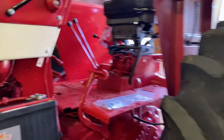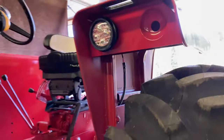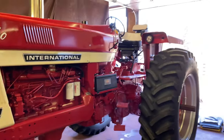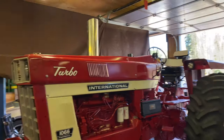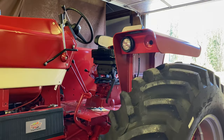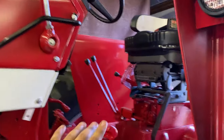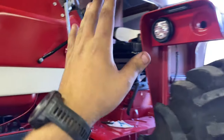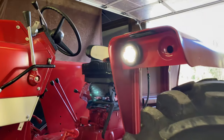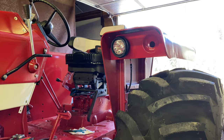I'm not sure how I'm going to set that up exactly, but I'd like it so that 'B' on the switch turns the floodlights on, which would be kind of slick — low beam, high beam, so you're not blinding everybody driving down the road. Note to self: if you have an old cab tractor with a blinker wiring harness for the turn signal, do not wire your lights through that by accident — that made these super dim. Now they are wired to the original cab light harness to run the fender lights, and they are way brighter. Weirdly, switching to 'B' makes them brighter still; I don't know why, but I'll check it with a meter.